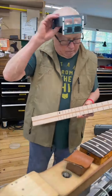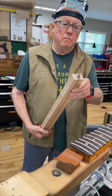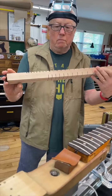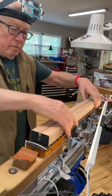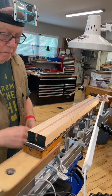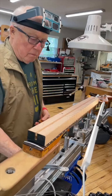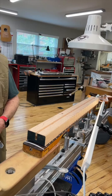This is a piece of maple that's tapered like a fretboard. It has a seven and a half inch radius and slots in it that sit over the frets on a 25 and a half inch fretboard. I use it to glue fretboards on that have been already fretted, but that's not its only use. It has a truss rod and can bend it into an up bow or back bow.